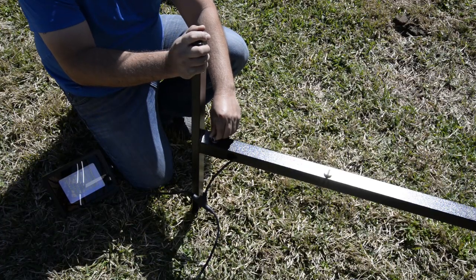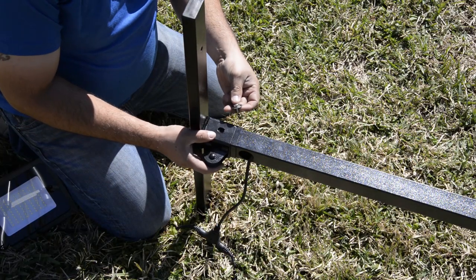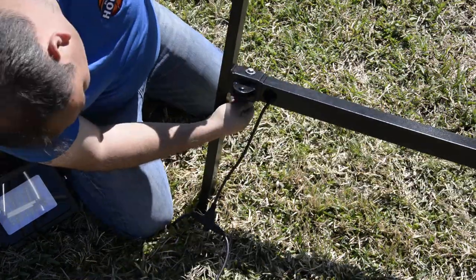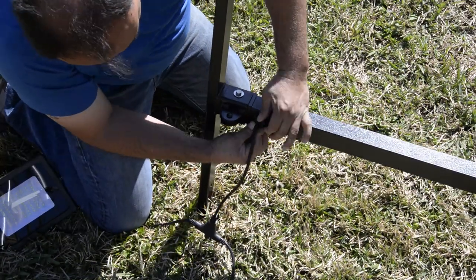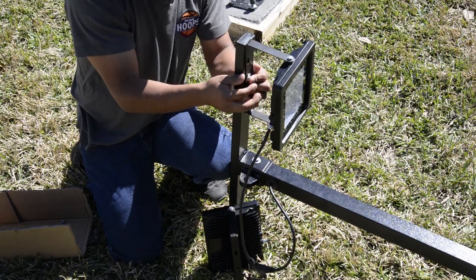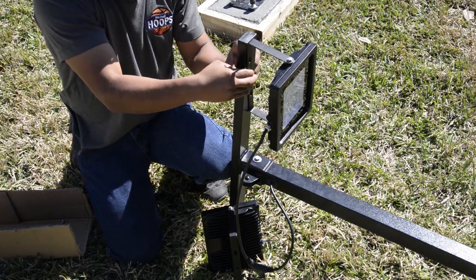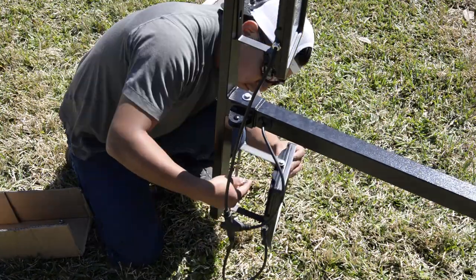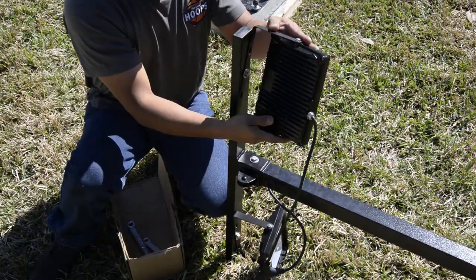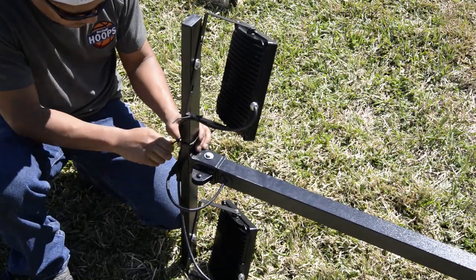If this is not a flagpole, install the hardware for your light bar. If this is a flagpole as well, you can go ahead and install your pulley. Next, install the rubber plug where the power cable comes through. If being used as a light, install your LED lamps as shown. You can mount your lamps on the bottom of the light bar or the top as personal preference. Be sure to tighten the bolts. Adjust your lamps as needed and tighten all of your hardware. Next, zip tie your cable down so that there's no loose wires.